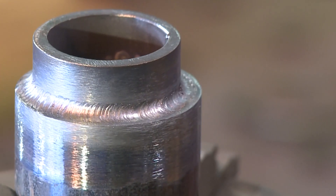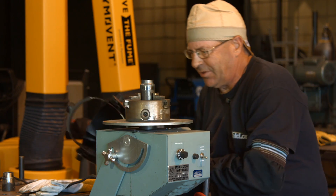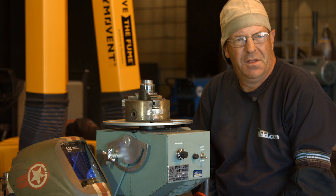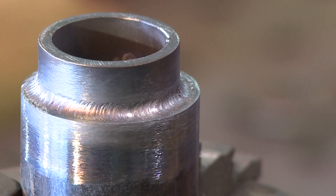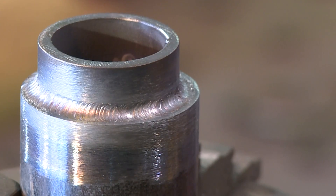I think this is what he called for — he wants it kind of cupped, doesn't want a lot of buildup, so I'll have to get with him. We've got some subtle variations we could study here, possibly do a pulse at about 10 pulses per second. I think this will work better on his parts because there's no gap — I've got just a whisper of gap in my tubes but he's going to have only a couple thousandths, so the 1/16 wire will probably be better. I was thinking maybe I could run the 3/32 wire in there, pulse it, make it jitter, and get a nice wet buildup. I have to try this a couple more times — it's kind of a game messing with the foot pedals and getting the two consistent.